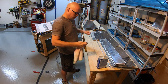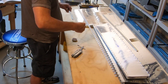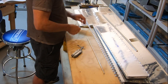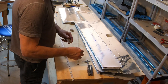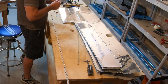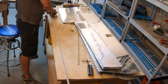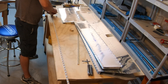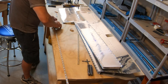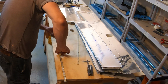Here I'm just cleaning up the trailing edge stiffeners and getting them ready to accept the 3M VHB tape. I chose to use this just for simplicity - I've read a lot of good things about it, holds well, it's easy to apply. Just double stick tape that runs right along the trailing edge stiffeners. Just make sure you clean them well, a slight scuff, then set them aside and let the tape cure for a while. Once you insert these and get ready to back rivet, just put them in place and click them in. I would suggest letting them set for at least 24 hours or so. If you leave it clamped together, maybe with a little extra weight on top, it holds extremely well.